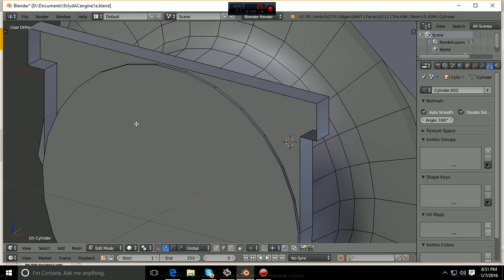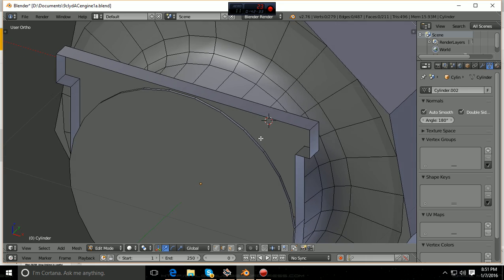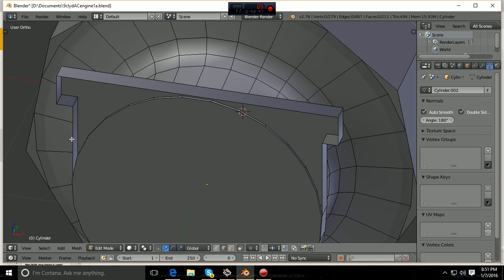Okay, now since we want this lip to stay here, now again, we're going to go through this thing where, now see, I could actually do one of two things here. I could make the face catch this lip, which I think is kind of cool. Or I could leave these faces smooth, and I could actually face all the way across here, which I'll show you. This would be a simpler method, if I just faced across here, even though there's some of the face you can't see behind the cylinder.